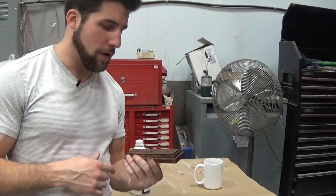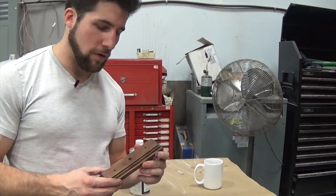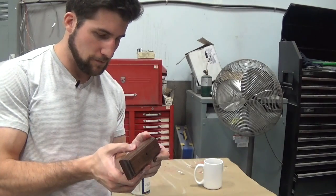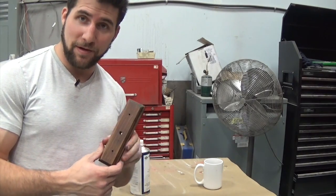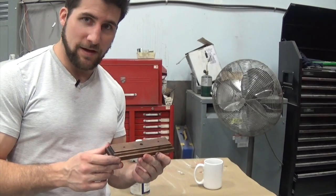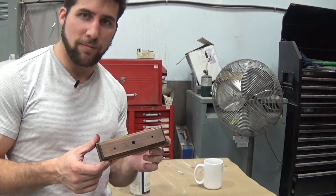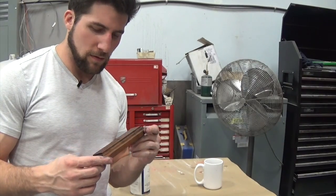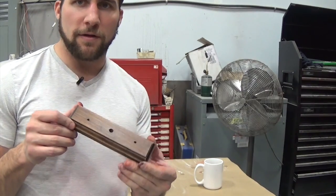So you might, if you were looking for that, want to go over this with a top coat of some description, perhaps an oil that glosses up more, or alternatively a lacquer, a semi-gloss lacquer or something like that, depending on compatibility, of course. I'm not sure what exactly teak oil is or is not compatible with, but I think if you built up another coat or two, it might gloss out a little bit more.